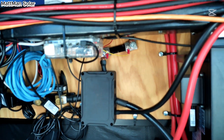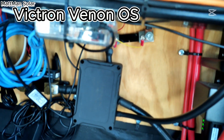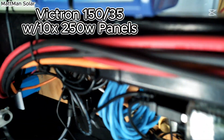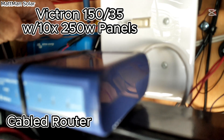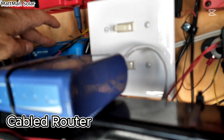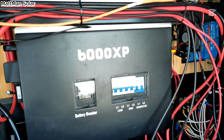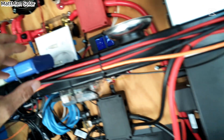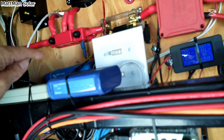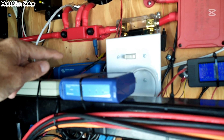There are quite a bit of different electronics around. This is for the Victron systems — it plugs directly into the shunt, and also plugs into the Victron charger that's back there. That runs the solar panels off of the solar shed, which you can see videos about on the channel. The 6000 XP runs the solar panels — 10 370-watt bifacial panels on top of the RV. And this other controller runs the 10 250-watt used panels I bought.